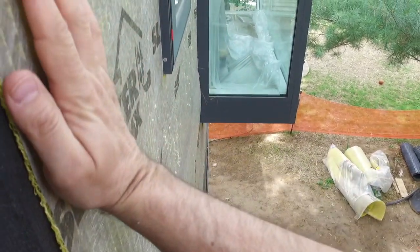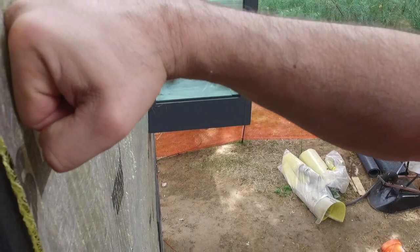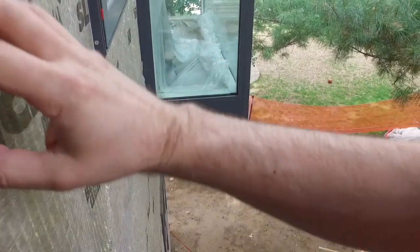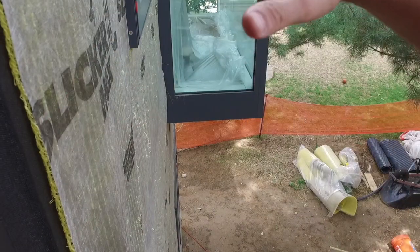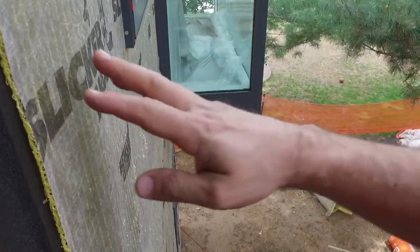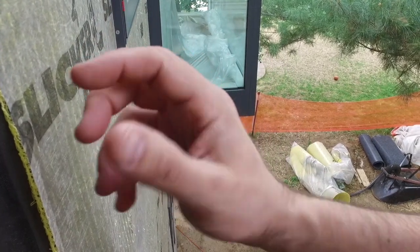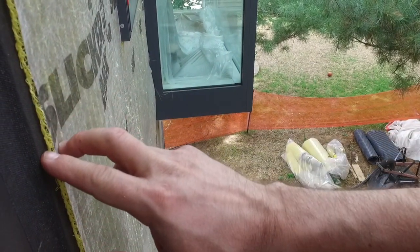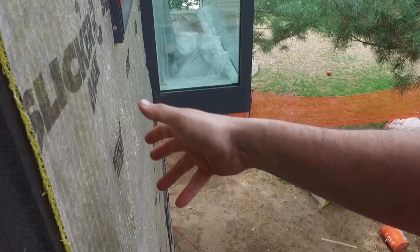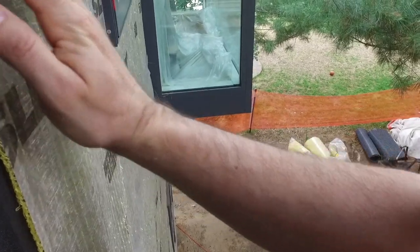When we figure our cladding material pushing against this, it's very, very difficult to compress that material when putting pressure on the larger surface area — kind of like a snowshoe. When you step on a snowshoe, it keeps you on top of the snow because of its surface area, even though it has lots of holes in it. We don't need a solid furring strip to hold our cladding system off the building. We can have something with lots of holes that lets air flow behind it in all directions — up and down, left and right, diagonal — and still resists compressive strength when putting cladding on.